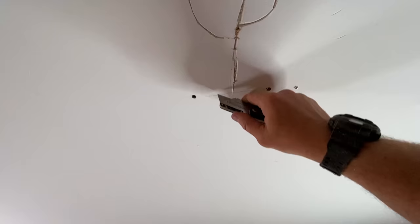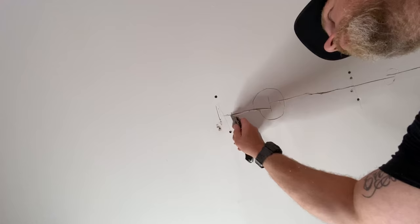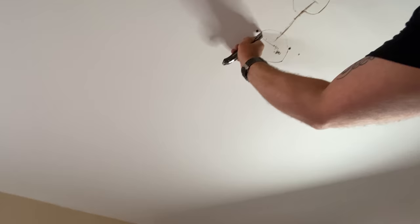This is just an added precaution and should not be needed if the drywall is secured. But just in case I miss something, this will prevent it from ever getting any bigger if it does come back. Now we have our drywall ready, it's secured, it's not going anywhere — hopefully. It's time to apply the first coat of mud.